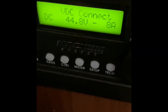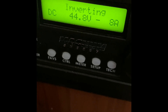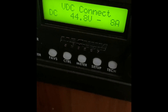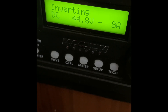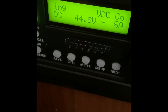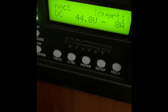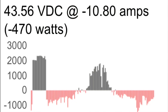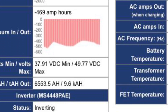It's working great, and I pray it just keeps on working great. I've got the new unit running in back, running full blast, and it is only pulling 7 to 8 amps at 44 volts. That's pretty impressive — it's about what the front one does, and it's a 12,000 BTU. The back one's a 9,000. Pretty similar how much power they pull. From our Magnum inverter, we can see we're sucking 10.8 amps off just the rear. Turned on the front one and it was up to 18 amps for both of them.